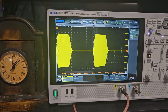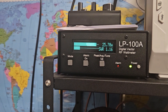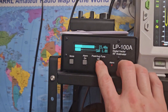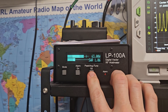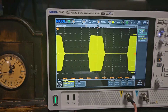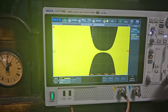This will be a part two — this is what you don't want to see, which you can achieve by over-adjusting the radio. This is AM high power. We started at eight watts, the average power is very high, the spectrum analyzer looks horrible. The peak power can't even register because there's just so much distortion, and the SWR meter doesn't know where it's at. You just don't want to transmit a radio like this — it's totally wrong.